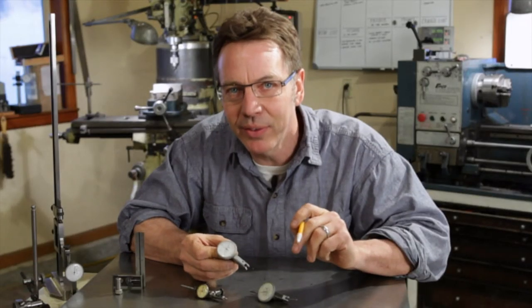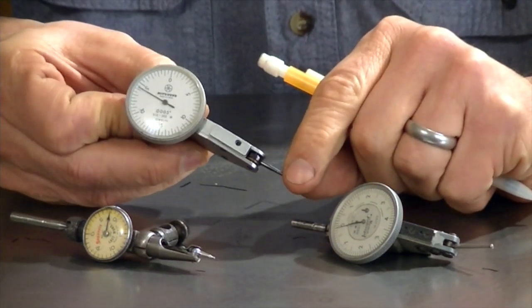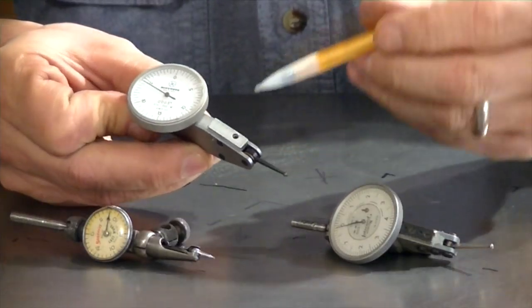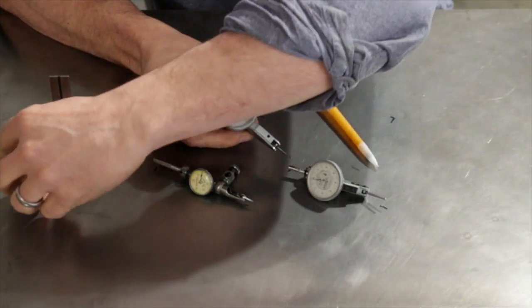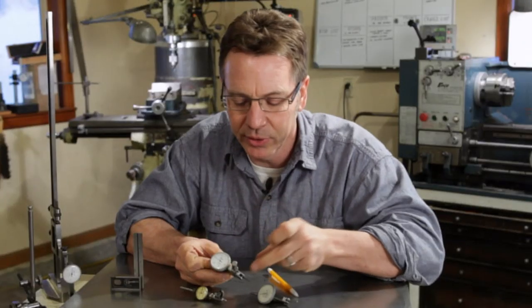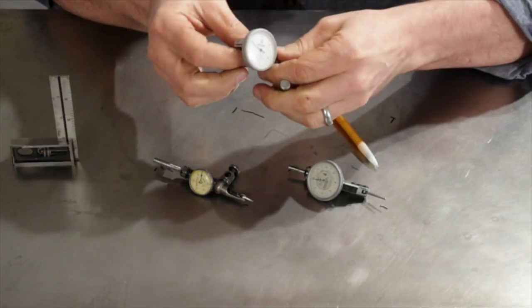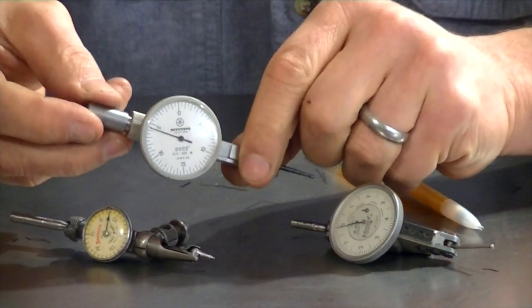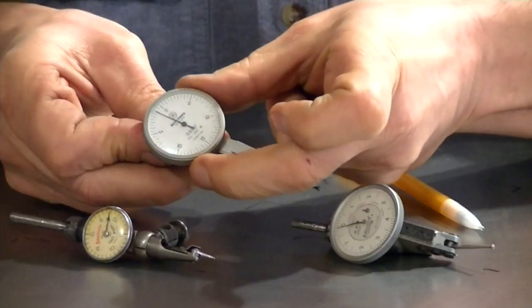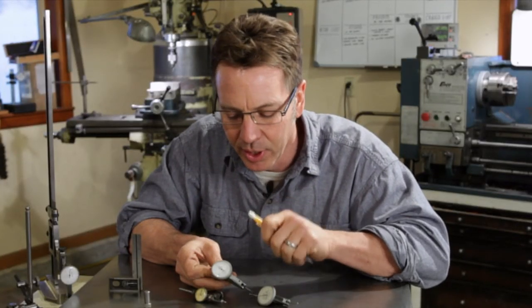Let's look at the Mitutoyo. This is a very modern version. Some of the things that are different: the probe actually reads in both directions, which is excellent — you don't have to flip the switch on the back. Another thing is it has these dovetails, designed to mount exterior posts on, so you can mount it on some sort of holder. There's a dovetail on the front, the back, and also the top, allowing you to put this post in different places to get this gauge into areas that a dial indicator can't reach. Similarly, the bezel rotates so you can zero it out. This one's accuracy is .0005, so that's half a thousandth. Great gauge.